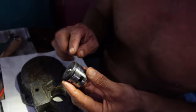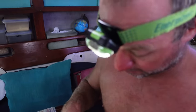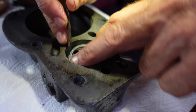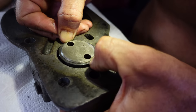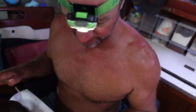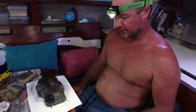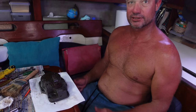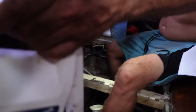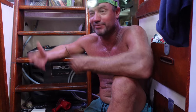There's not much tolerance there, so if it does leak I'll just go a larger O-ring, and if all else fails I'll have to get a new machined piece. Sliding the retainer on — it locks in. That's back together and ready to put on the engine — just another six, seven, eight bolts to go back together. Connect the shifter lever and we won't know until we try it. The oil is full. Job done — the next 50 miles we'll see how it goes.